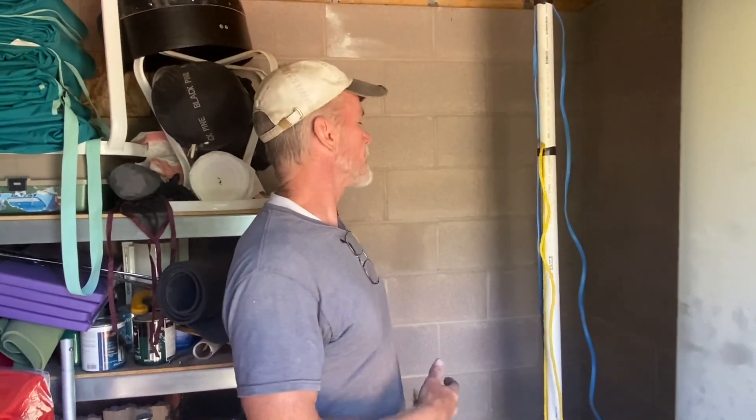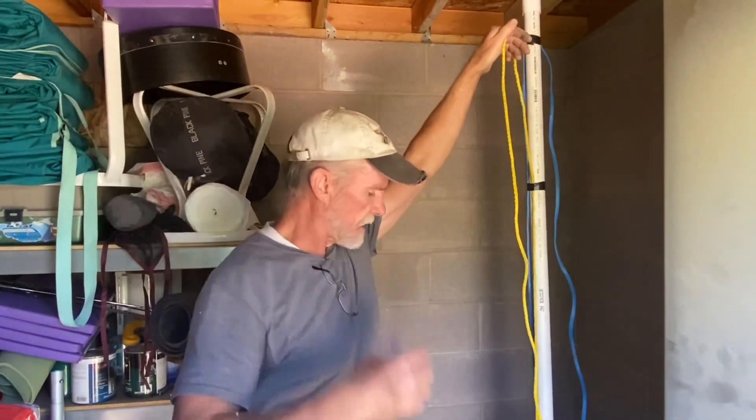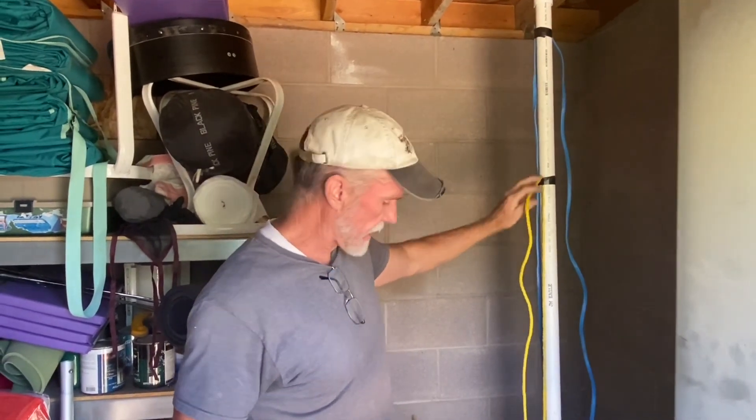So what I've done here to get set up: we have a rope here which is going to stay with the pump, so should there ever be an issue in the future we can pull it back out. This will go down in — it also allows us to lower the pump and lower things in because we've got to assemble the pipe as it goes down.